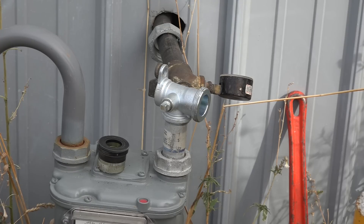The only way to leak check this is with soap bubbles, because the air or gas you're putting in there won't be detectable by an electronic gas leak detector. So you'll use soap bubbles. I'll pressure it up to 5 or 10 pounds and start looking for leaks, then come back and see if the pressure has dropped. Sometimes you have to wait a half hour before it comes down, but that gives you plenty of time to go over a lot of fittings.